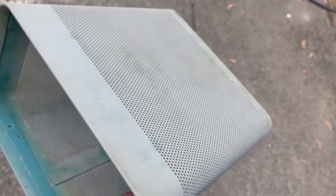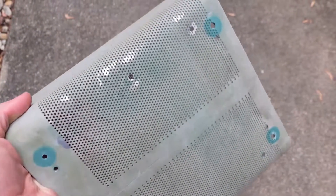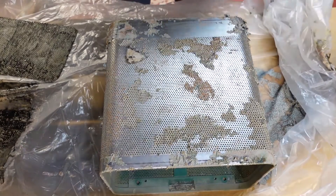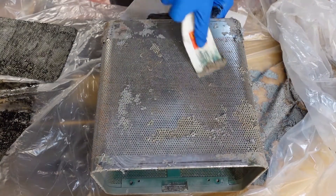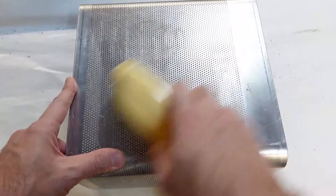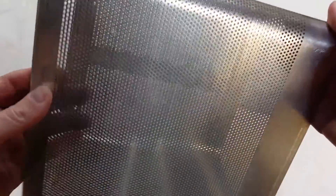With the HW101 case halves looking sharp, I moved on to the speaker case. This is what the SB600 looked like after multiple cleanings — the paint was permanently stained. Initially the stripping looked like a winner with paint coming off in large chunks, but I greatly underestimated how difficult this was going to be. Think about it: this case is essentially a giant strainer with more than 10,000 tiny holes, and each one of them has paint on the inside surface. I ended up using two coats of the stripper outside and inside the case, a lot of scrubbing in the utility tub, and scrubbing again when dry because paint was still flaking out of those holes.